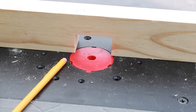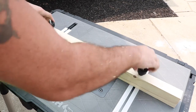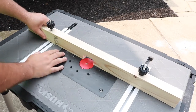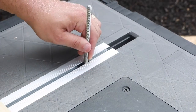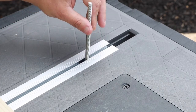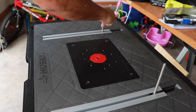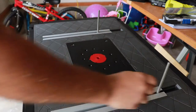I found a little issue with the tracks. The one on the left-hand side is a little bit tight — I noticed that the screw is actually hitting up against the track, where the one on the right slides a little bit easier. The right one glides nice and smooth making the fence able to be moved, but the one on the left — that bolt is actually touching the fence. The gap is a little too small. Disappointed in that. To be fair, we did try this on a second table and the second table alignment was fine. This one here was the one that gave us issues, but at the end of the day they should all work fine.